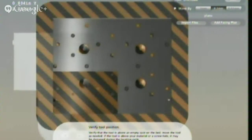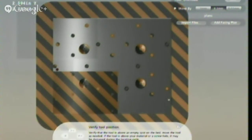What the machine wants to do now is it wants to know where the tool is in space. So it knows where it is in relationship to the bed, but the tool, you have to select the tool every time you change it, and what you do is you touch up on the bed so that it knows how high it needs to go to lower itself to the right height of the tool. So, you make sure that the tool is securely in place, and you hit verify tool position,